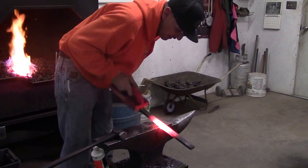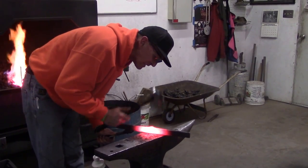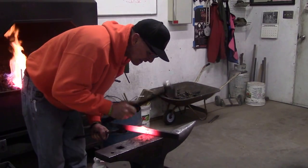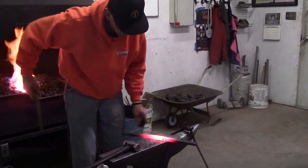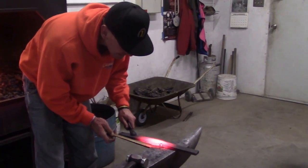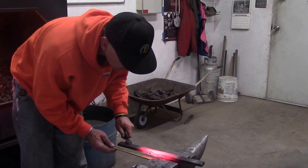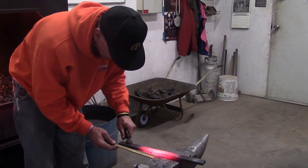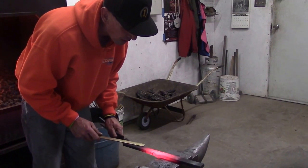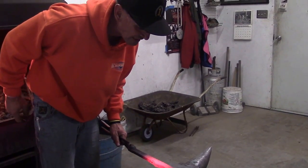At this point, I haven't committed to making a left or a right, inside or outside. So now I'm praying and hoping that I'm off a little bit. So if you get your ruler out, I'm at 9 inches on this side. I'm at almost 8¼. So this will become my medial side. That's important. So what I'm going to do is bump up this outside a little bit to give me that nice outside heel.